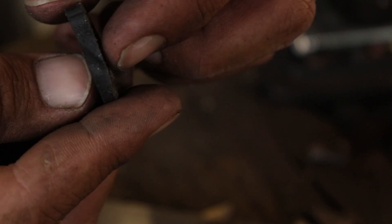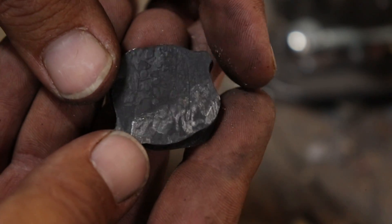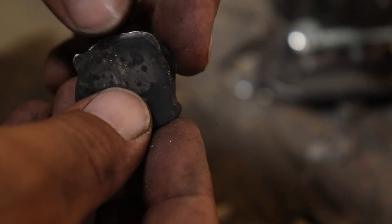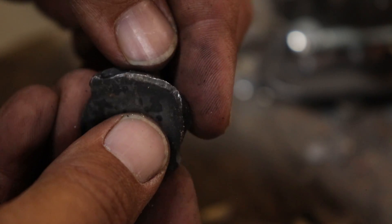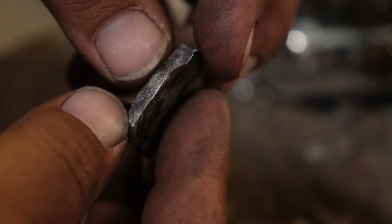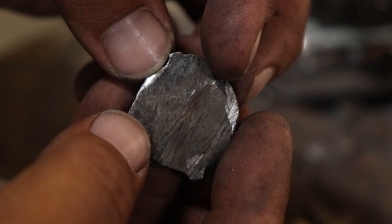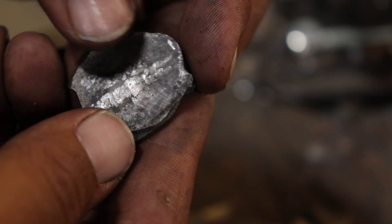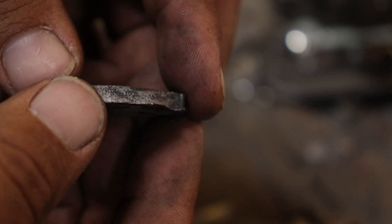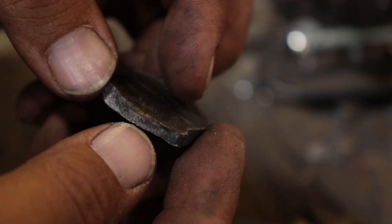Now this stuff here — the oil quench one-inch piece — I couldn't get it to break or bend, but it's also a pretty decent-sized cross section. So it may just be because the piece is too thick. It is kind of bending over the edges, which makes me think it's kind of just case hardened — stiffened up a little bit. And the same with this water-quenched one: you can see right there where the hammer bent that over. I would say this has maybe a little bit better carbon than just mild steel, but the carbon content is pretty low. Still, I think I will use it for tooling; it just may not last as long.